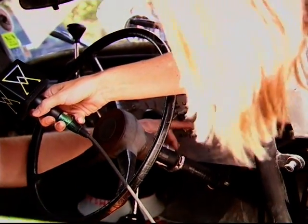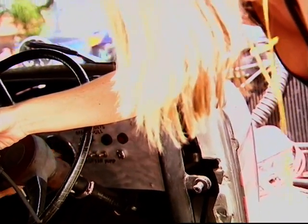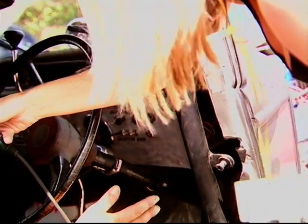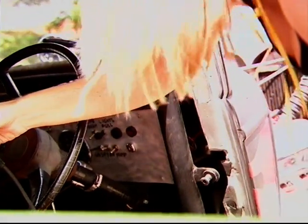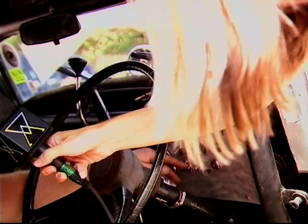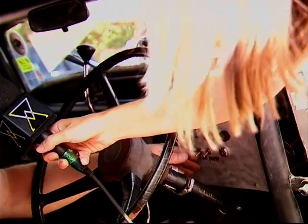I've got the water pump on the engine manually controlled, so when I come to a standstill and switch the engine off, I can put the pump on, and it still circulates the water, stops the engine from getting a hot spot and cracking the heads. And the fan is also manually operated, so I can just keep it cool.